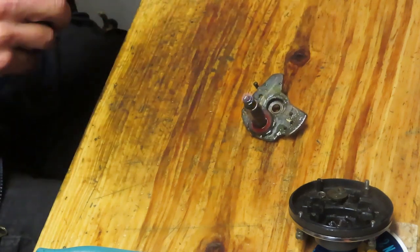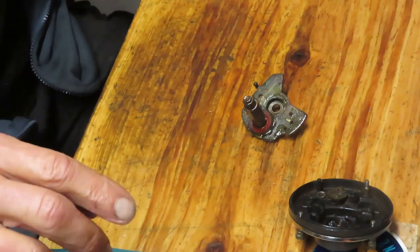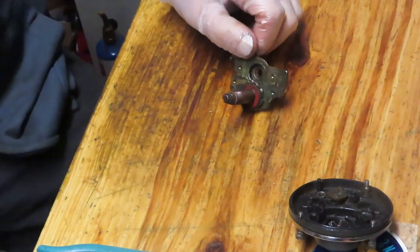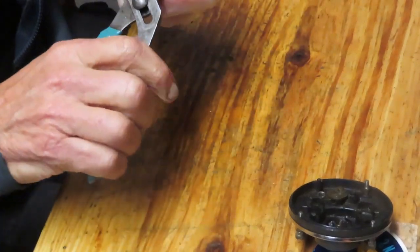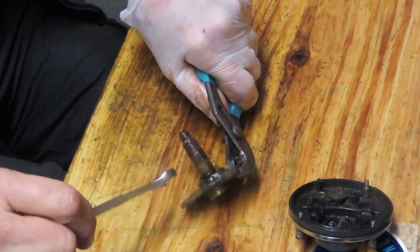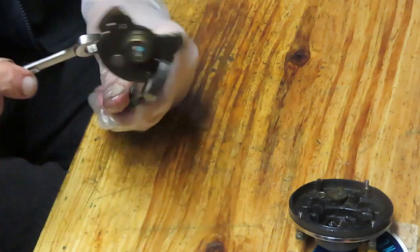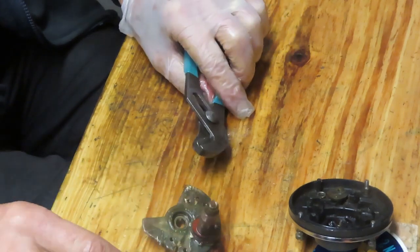I can see the penetrating oil I put in on the sleeve is bubbling, which generally means the heat has made its way through. I want to be careful as I hold this and let the heat transfer to the bridge. Now I'll take the pliers and see if we can move it. We wanted to turn the bridge — and we can. Unfortunately, I can see that the stud is turning too, which means the rivet in the back is turning. That says we have a bridge with a frozen gear sleeve on it.